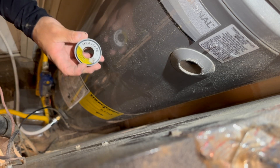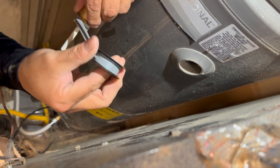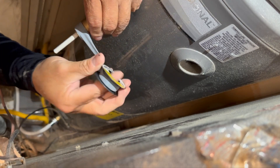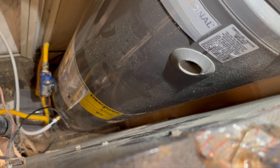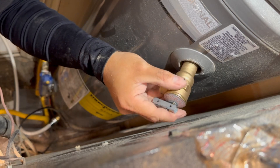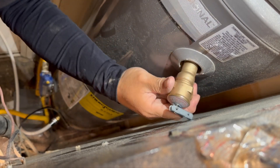Mega Tape is probably the best on the market right now — it's two to three times denser and can be used on gas lines. This valve comes prepped already with some tape on it, but a little extra can't hurt, and putting it on the correct way can't hurt either. Since it came prepped I don't need a lot. I'm in a tight closet area where there's a door — my stomach barely fits — so I'm having a little difficulty, but that's what it is. I thread this on by hand, nice and easy. Once you know you're threading on good, this one's a little bit longer but it doesn't matter.